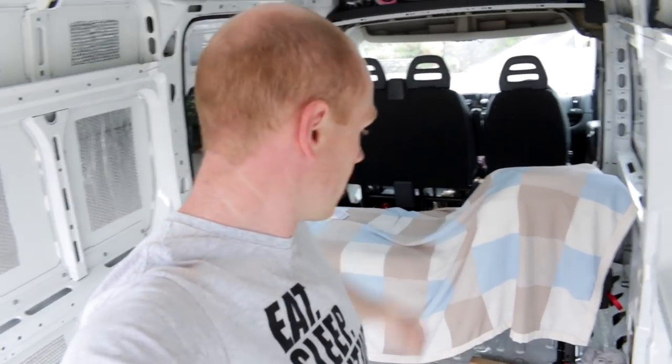I'm not going to go into crazy detail in all the insulation methods we're going to use. Today's mainly just going to be about the floor, which is going to be built up of battens, PIR, rigid, solid insulation, and then a plywood sub base. And then the last job is just to remove the seat so we can have a clean sweep.